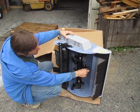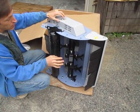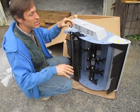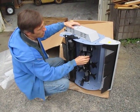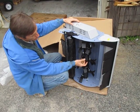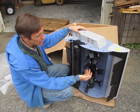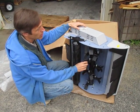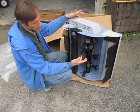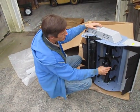As you can see, there are lots of blades, staggered all over the drum so they give a very smooth cut. We've tested this model against the BCS flail mowers and find the blades are staggered much better on this machine, so it doesn't miss as much material. The blades are reversible — sharpened on both sides, which is standard for all flail mower blades. When they're completely dull on one side, you flip them over and run the other side. You can sharpen the blades, but with so many it's very labor-intensive, and a lot of people don't bother. Usually you run one side until it's worn back, then flip it, and that gets you three or four years of cutting total, then you just replace the blades. They're about $2.50 to $3 a piece for the Berta, so they're not terribly expensive.